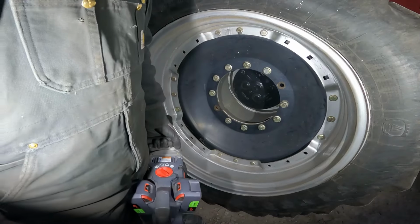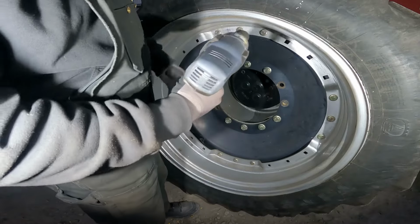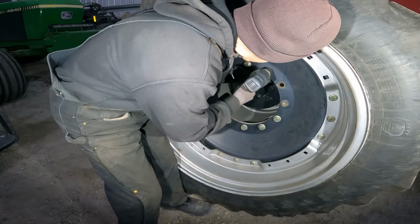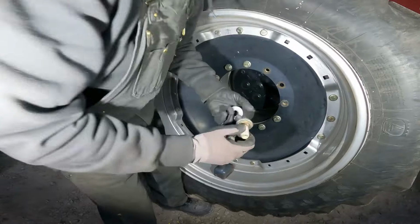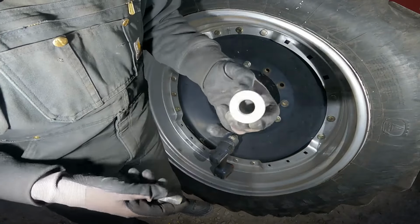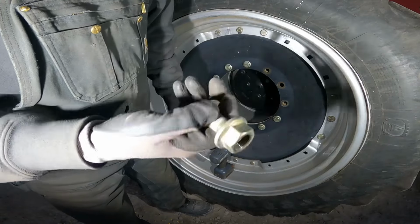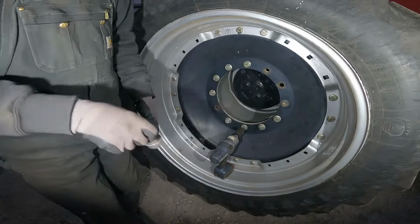Grab the 1/2-inch. All right, got the 1/2-inch drive. This is just so much handier to work with, just finish spinning them out of there. Okay, right there's a big cap nut. It's got that big shoulder on it. These are actually a metric bolt. However, 1 3/16 matches up pretty good to take these out.